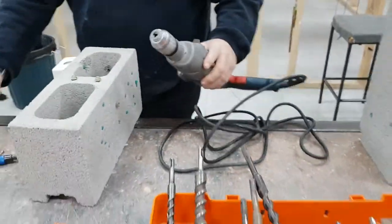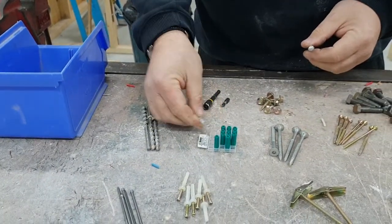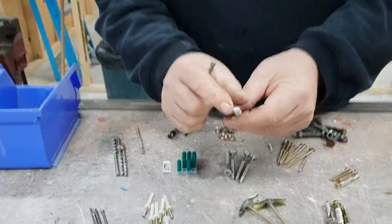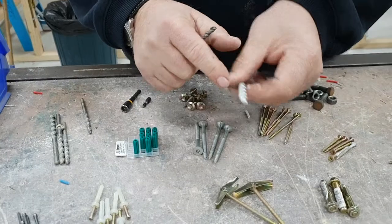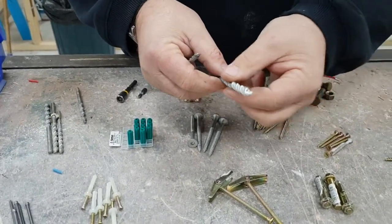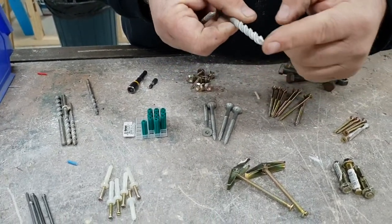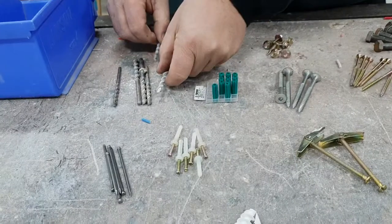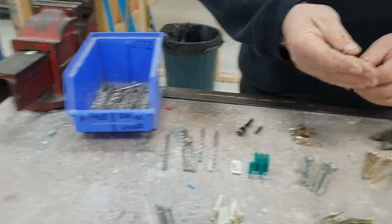You've got a keyless chuck. Most of the drill bits you'd use for this are the type you buy from Bunnings. We've got a few different sizes in tungsten — for example, a 6mm and 6.5mm, and a few other types. The little tungsten bit on the end is what actually does all the work. Without it, the bit would be chewed out in five seconds — a normal mild steel drill bit wouldn't last. The flutes along the side take the dust out of the holes.